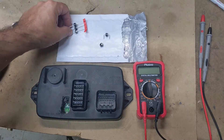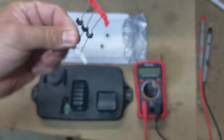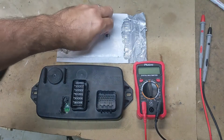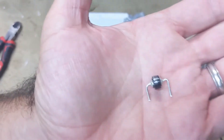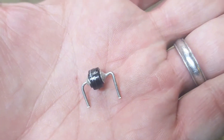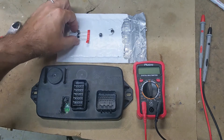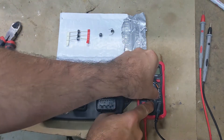Okay, so we've got our new diodes in and they're exactly like the old one. I've already cut one of them down so that we can solder it in place. But before we do that, let's go ahead and check it — I've got my multimeter here and I'm going to turn it to diode mode.